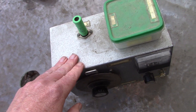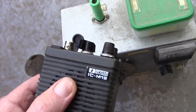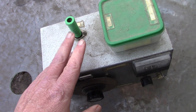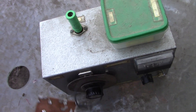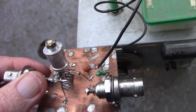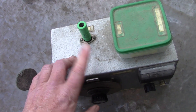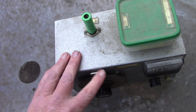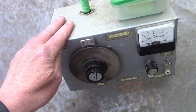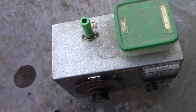As a result, given that this is receiving VHF marine band, we're using this as the intermediate frequency — that's 156 to 157 MHz. All we need is around 10 MHz coming from here, and that will allow you to receive signals on the 2 meter amateur band, around 144 to 148 MHz. If you want to change the signal that you're receiving, you just vary the local oscillator. And as it's only around 10 MHz, it's reasonably stable and will receive FM signals quite well. If this local oscillator were running free at VHF, there might be problems, but down at 5, 10, or 15 MHz it's stable enough for FM transmissions.